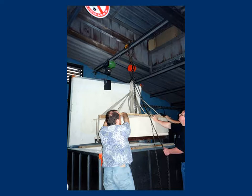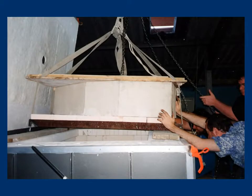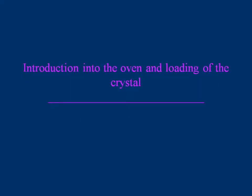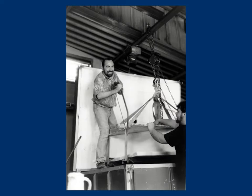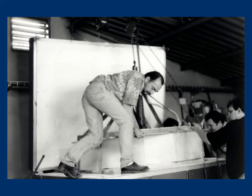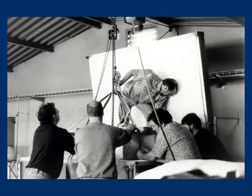This is why both sides were coated in kaolin — that is to say, a lubricant. The mold was then positioned on the sheets. The bars were then used as a support for the slings. The woodsheet protected the mold and served as a guide for the slings in order to avoid the bars moving during the lifting and shifting operations. The slings had to be carefully set so that the mold would sit in a perfect horizontal position. A second chain hoist allowed us to move the piece horizontally and set it above the kiln.